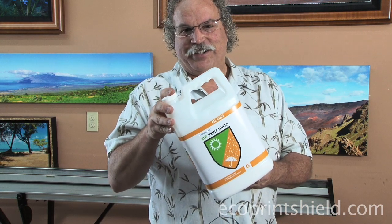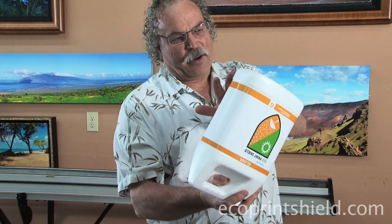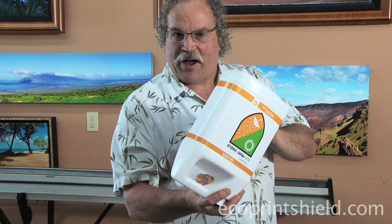Agitation of your Eco: don't vigorously shake the product because you don't want to inject more air bubbles into it. Just rotate the product slowly back and forth, and notice when you look at the bottom that you don't have any solids. If you do, thoroughly mix those.